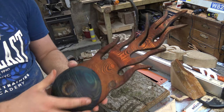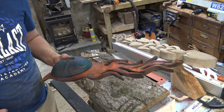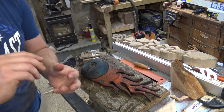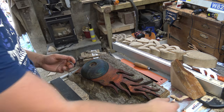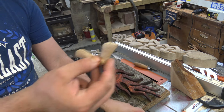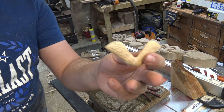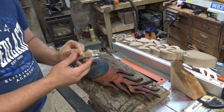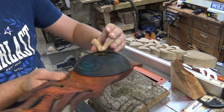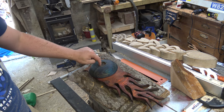Lid on top — we're going to need a little holder for the lid. I want to get all the elements in: I've got fire and water, and I thought about wind. I wanted it to be a wind-related wood thing, and the first thing that popped into my head was sycamore seeds spinning off the tree like helicopters. So I drew out a seed, cut it out on the bandsaw, and did a little bit of wood whittling with a whittling knife to get this little seed pod. What I want to do next is turn a little base I can attach this seed pod to, which will come off the top as a little grip handle for the lid.